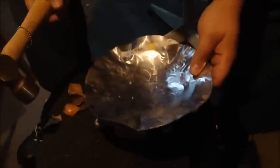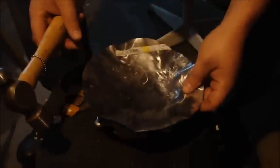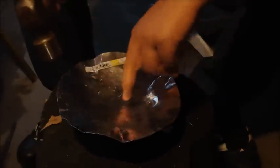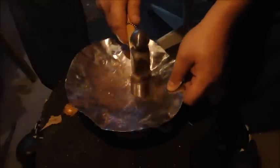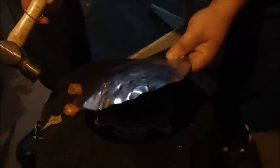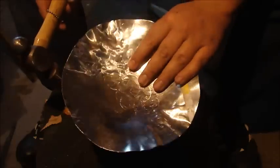You're going to have the best luck working in a spiral pattern coming from the inside out. Because you're working with a smaller void than what you need for the actual boss, you're going to run into backtracking if you try to hammer in the middle and then move to the outside — you'd be moving the indentations the wrong way. It's best to stretch the entire thing from the center out. Just start from the center, move your piece in a spiral to the outside, flatten around your edges if you need to, and keep working. You can already see I'm starting to develop a dish shape.